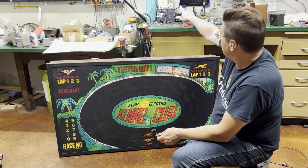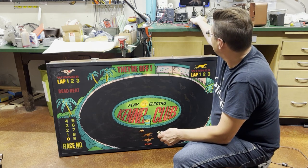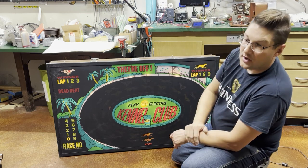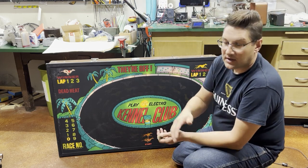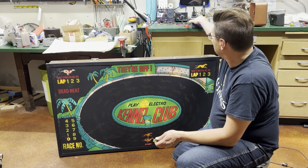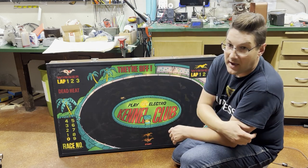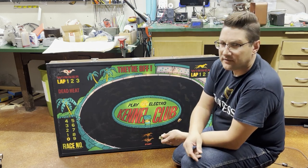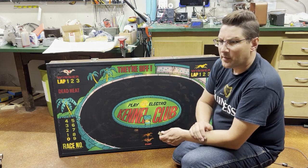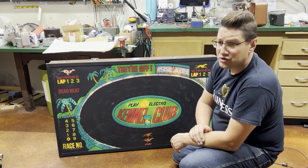You might be able to see up here — I've got nine volts feeding this transmitter, and when I press the button it draws 0.04 amps, and the other one does the same. It looks like it's in good shape, no corrosion. I just have to replace the two nine-volt battery connectors in both of them. This is supposed to be two batteries in parallel giving nine volts but with more amps available. I need to replace all those battery holders in both of them, get four batteries, and clean them up — then they should be pretty much ready.